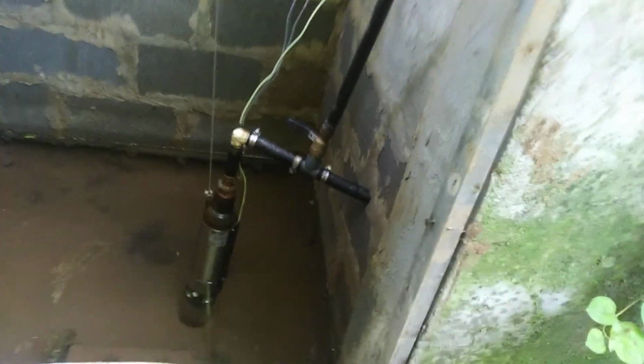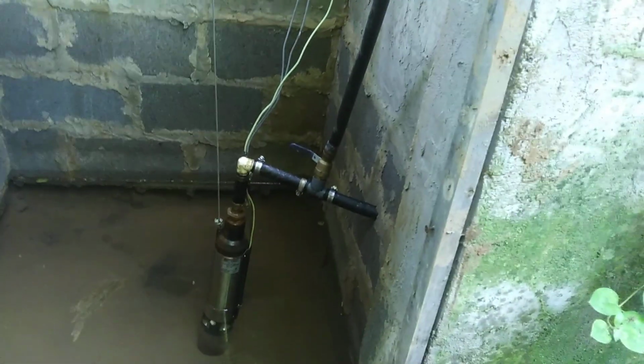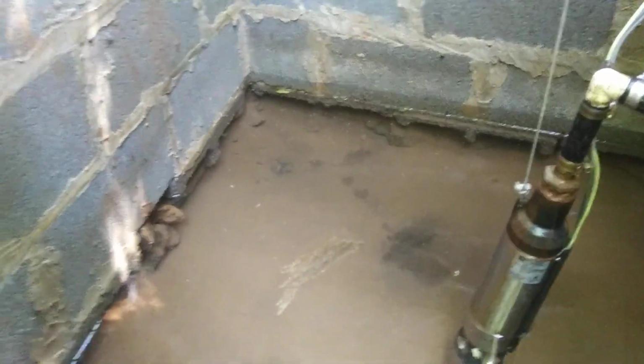Now, when I had this thing drained, I drained it all out. I tricked the pressure switch into thinking that the pressure tank needed water, so I was able to bypass the wiring that I've got in under the house. I've got this pipe up here. I was just pumping it all out real quick. And the main source of water is actually coming from that corner. It's flowing right in, and then all along the back edge, there was water pouring into it. I didn't even see that right there yesterday, but now that it's settled, I can see it's, hopefully that quality is good enough. It's just bubbling in, pooling in from the bottom.